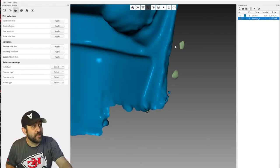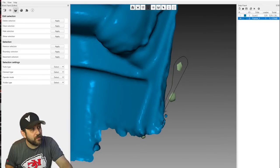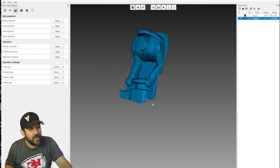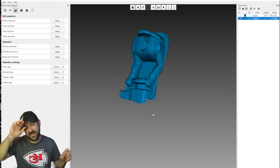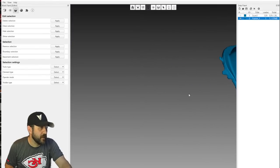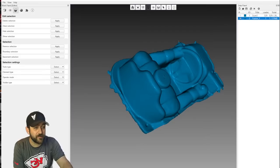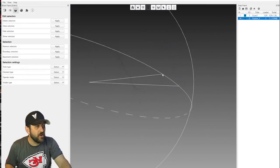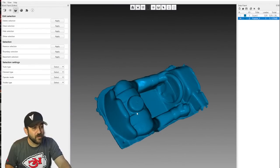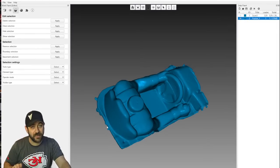So if that gives you any idea, you don't need to spend a ton and you can get it done. I could use my big editing PC with a lot more horsepower and a better graphics card, but this doesn't really even bog down. How many gig does my editing PC have? Out there, I've got 64 gig in. And the laptop that I use on occasion is an Apple, a big, crazy specced out MacBook Pro. If you're doing editing, graphics work, or video gaming, 16 gig is where I would tell you to go. You don't need more than that, but it's nice to have. If you can get 16 gig, that's a good place to start.